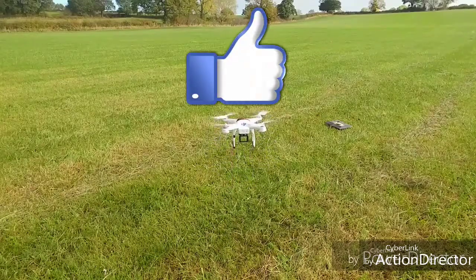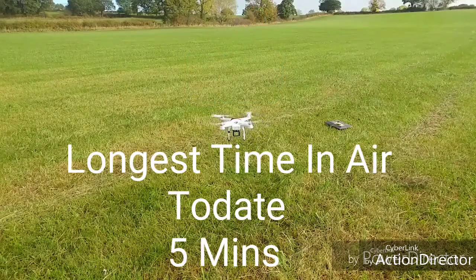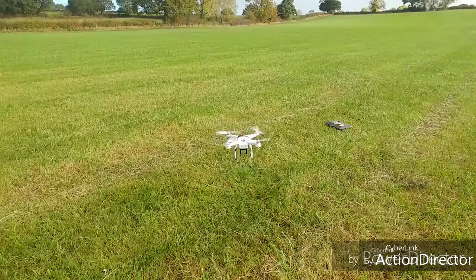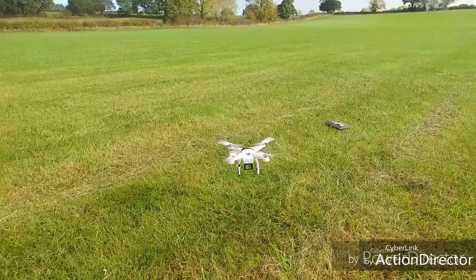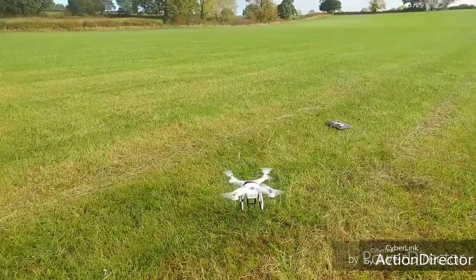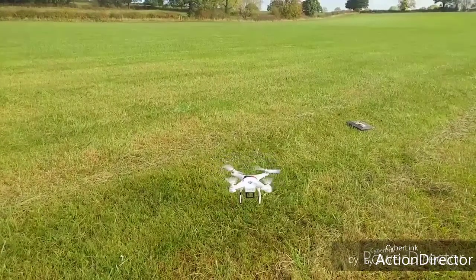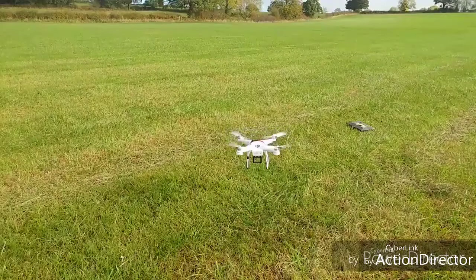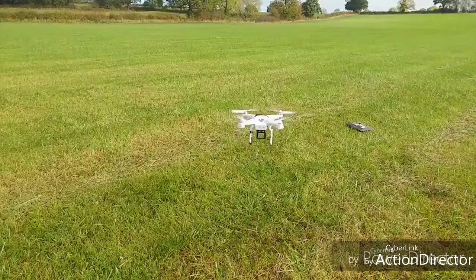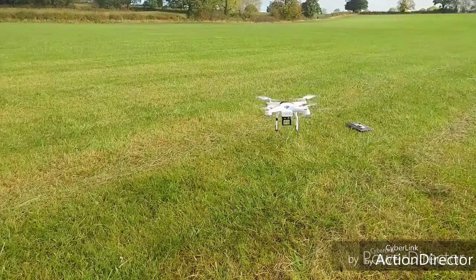The guy told me he'd already fitted a new motherboard, told me the ESC was fine when it wasn't, so I don't actually take his word for it. The motherboard may be new, but he has done such a bad job with the soldering. It's that bad, the wires are as wide as my little fingernail from the wires that come off the ESC. He's pushed down so hard on them to get them to solder that they've spread, and the pads are quite small on the motherboard.